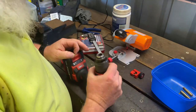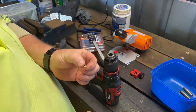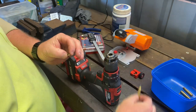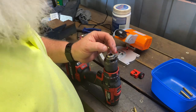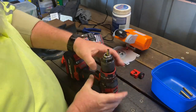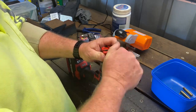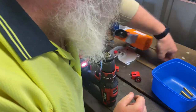We've got a drill — just turn it upside down on its base there. You could call it a spacer: what I've done is just take the necks I've chopped off some other ones, flattened them down to different lengths, and it will just sit underneath the empty cartridge and push it up enough to give us the correct length to chop it off. That's the theory anyway. Get him in there so he sits upside down in the drill. Get our cutter — we'll use our big one. Tighten him up, hold him down. There he is — easy as you like.